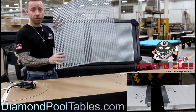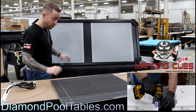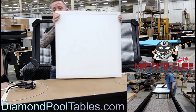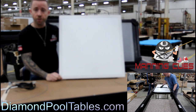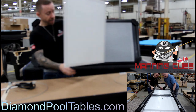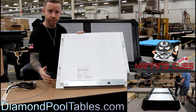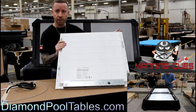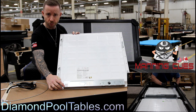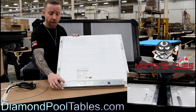The diffuser reflects the light that comes from the LED panels above it. Behind this light is an LED panel provided by Keystone. It has three different settings for wattage and three different settings for correlated color temperature. On the back inside of your light — though you don't have access to this as a customer since it comes fully assembled — there are two switches. One is for wattage and one is for correlated color temperature. You have 3,000, 4,000, and 5,000K color temperature options, and 20, 30, and 40 watts.